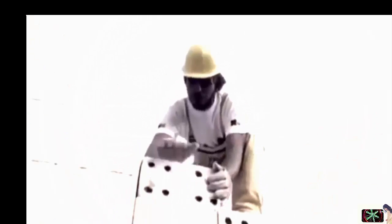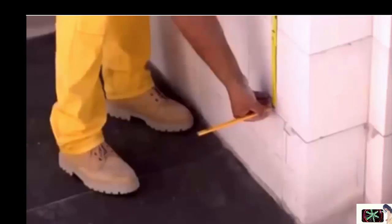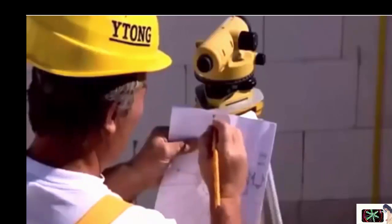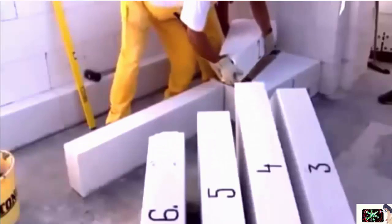The construction ran really quickly. Even the staircase was ready. I thought up a curved staircase, and according to the design, the producer made some atypical stairs. At the building site later on, we set the stairs within a few hours. Lay load-bearing dwarf walls on hydro insulation in a layer of lime cement. Set the first stair higher by the floor thickness.